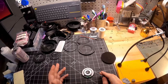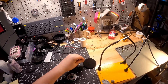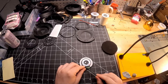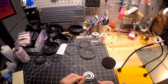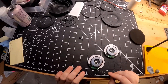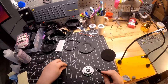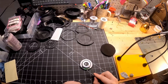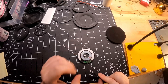Go ahead and remove the two cables — I already have them removed here in this example. The next thing is this capacitor that goes from the main lead to the ring radiator speaker on the outside. We're going to desolder and remove that. Be very careful not to accidentally rip off the solder pads like I did here. Once you have those two wires and the capacitor removed, you can leave those two resistors on there — it's not going to matter because they're not going to be in the chain.